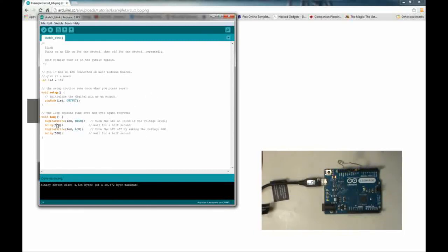If we want to change the blink rate, we just edit the delay value — let's change it to one second by setting the delay to 1000 milliseconds. Hit Upload, it recompiles and re-uploads to the Arduino, and now we can see the slower blink. That's our simple blink program.